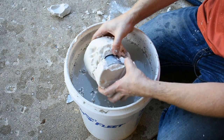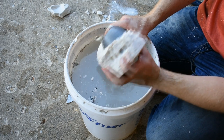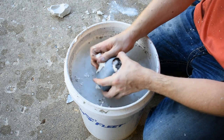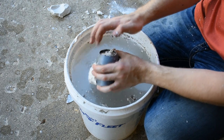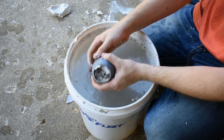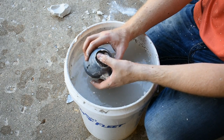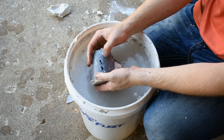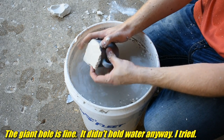Failure. You are seeing the cup — gross. I got the base of a cup, and I got a 3D-printed cup severely warped from all the heat, but I did not get a cup made of aluminum. Time to try to figure out what happened. This cup gets very thin right around the transition from the base to the wall. I bet that's the problem — I bet the plastic inside did not get hot enough to melt out, and the aluminum solidified in that thin space before it could run through and burn out the rest of the plastic. So I still have a 3D-printed cup — look at that. But that did not work. I'm full of failure lately, aren't I?